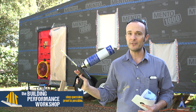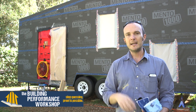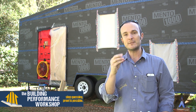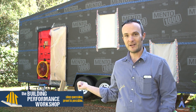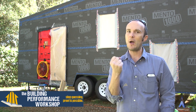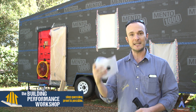I've actually taught classes on how to apply this stuff, and that is part of the reason why I decided not to use it. This foam has a little bit of skin on it, but if that skin gets damaged at all, we have a problem, because the foam is really good at holding water. We have a tiny house that's going to be traveling all over the country for the Proof Is Possible Tour — I'm assuming everything in here is going to get wet at some point. I want it to be able to dry out and not hang on to that moisture like a sponge. That's why I'm not using spray foam for any air sealing.